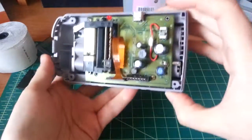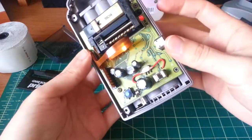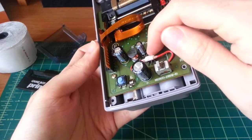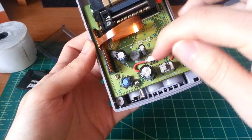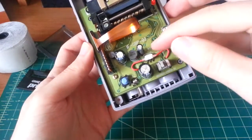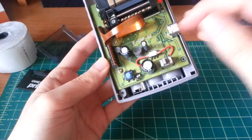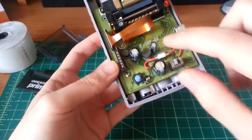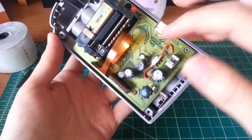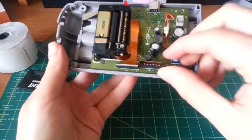There's a red LED, link port cable, and you'll notice a fuse in there, probably for input protection. There's actually a transistor underneath there — it's thermally bonded to that component. So that's actually a thermal cutoff: if that transistor is overdriven and gets too hot, it's probably a resettable fuse that'll turn itself off to protect the switching device. You'll also notice filter caps and an inductor — it probably uses some sort of switch mode supply. That switching element generates higher voltages than the six double-A's provide to drive the thermal heating element.